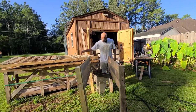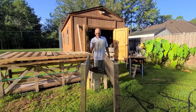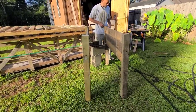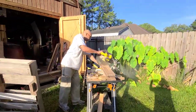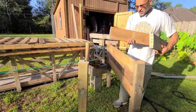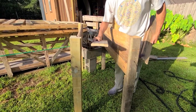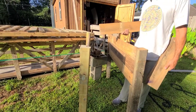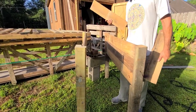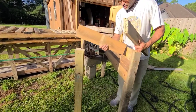It's getting ready to fall. Yeah. So I grab one piece of wood, cut it at 24 for each side, tack it in, and then I'll have to show you what we're talking about. All right, I got to reach out. What you going to do on the inside? I'm going to try to put a cleat to go all the way across. So my bottom could just sit on top of it. It won't have to really be screwed down to sit in place. Okay. You have little gaps in between them if you like. So your water can drain out through your membrane. Sounds good. Yeah. Put these in.